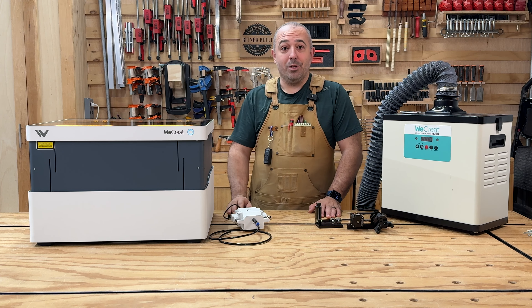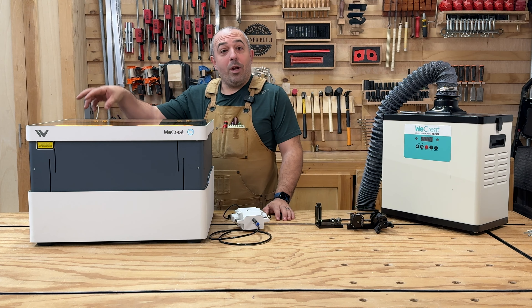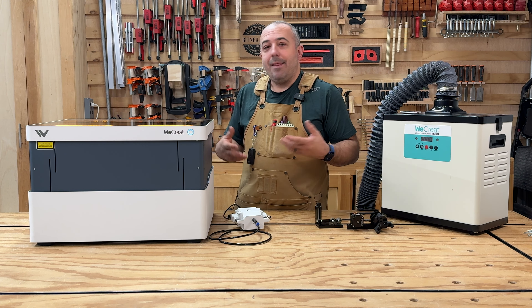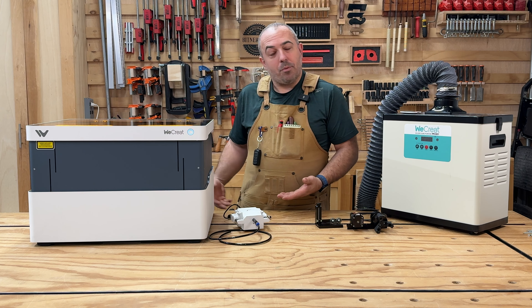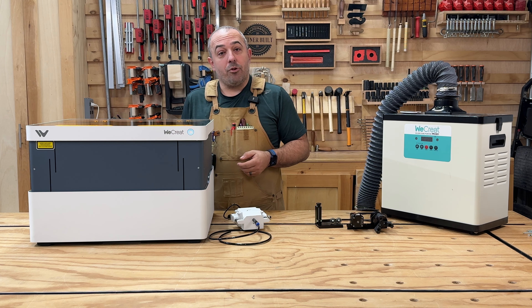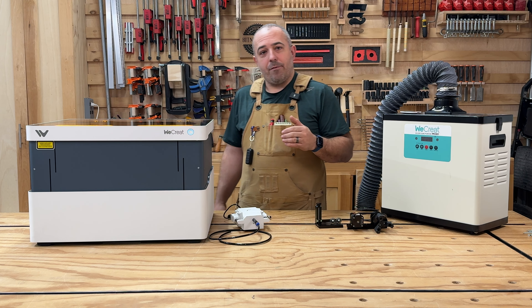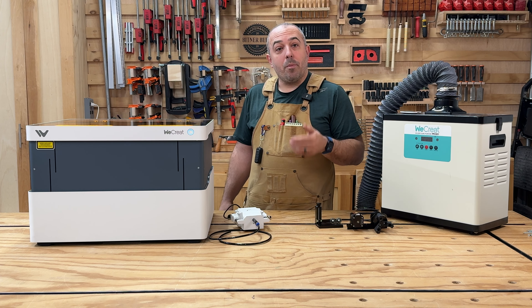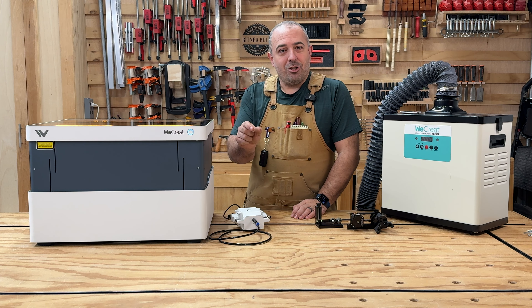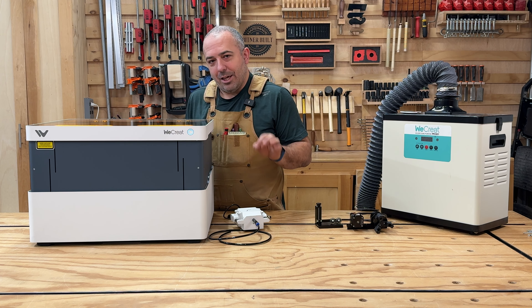This unit has a 20-watt diode laser, and currently there are no other modules that you can put in with it. This is a company where this is their first laser product, so I'm sure they're going to be expanding upon it as time goes on. 20-watt is good because it is very, very good for engraving. It does hold you back a little bit from cutting thicker materials, but as you get to a more powerful laser, the kerf of the beam actually increases — just like the blade on your table saw. So 20-watt is seen as the best current size for diodes in the engraving space.